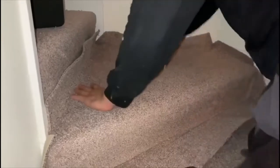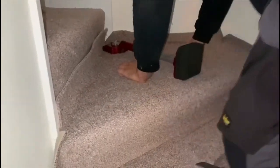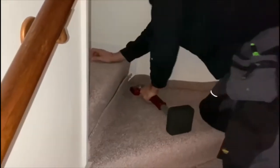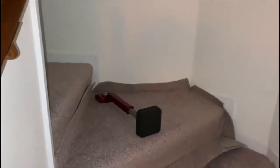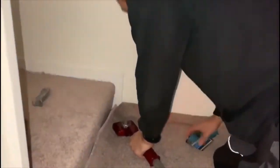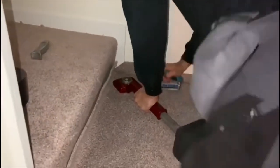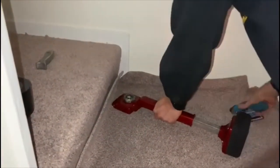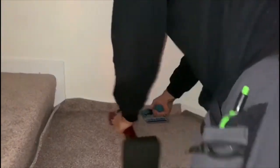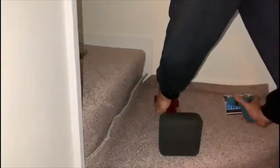Then you can lift this wall up, get your stretcher. For me, I like to stretch straight into this corner and then kind of gradually build it there, build it there, so it's got an even stretch. This is very, very cheap carpet, so probably not the best carpet to demonstrate with, but nevertheless — you just hold that, mash that on, and then I'll pre-hold this and just gradually work my way in.